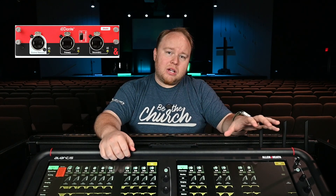The first thing you'll need is obviously a console that takes a Dante card. If you're unfamiliar with this, this is an I/O card that goes in the back of the console. It's made by a company called Audinate. They have the Dante communication protocol, which is audio over IP. You will need to make sure that your primary console is set as your master or clock console so that everything in your Dante network lines up to the same clock. In this case I have the Avantis set to be the primary and it is where everything clocks out from.